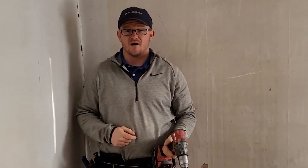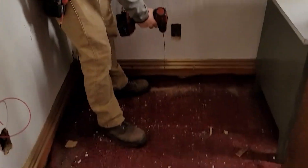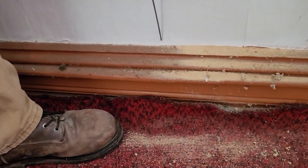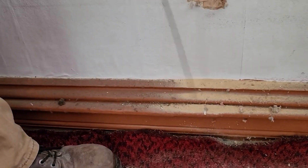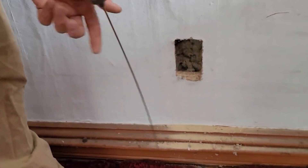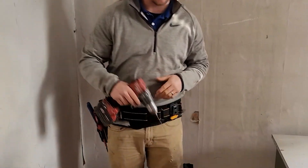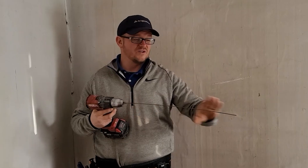You can also use these to go through the floor. If I'm installing floor receptacles and wiring them from underneath, I'll come to the edge of the trim or on the back side of the trim — you may need a longer one with excessive trim — but you can literally sneak right behind the trim. All you end up with is a tiny hole. In houses being retrimmed, you can walk right to the trim, screw it down through the floor, then go down in the basement and it will let you know where the flag comes up.